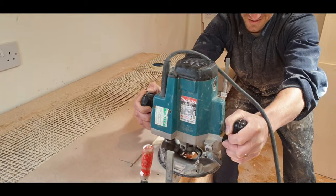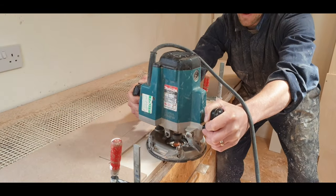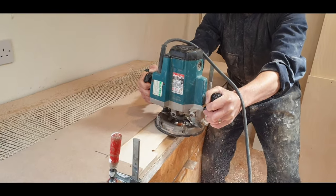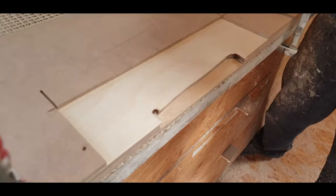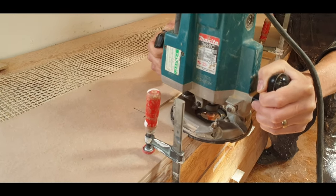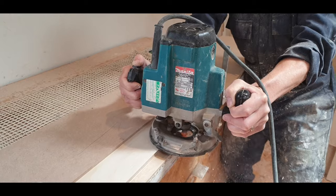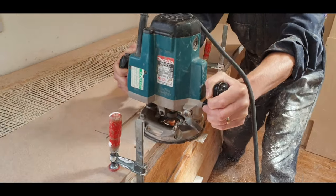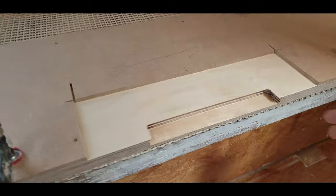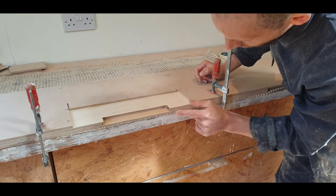It's driving so much better on the melamine. So that's the meat taken out — going for it now and going around the perimeter. One drawer fascia done. Let's take it off and show you what that looks like. You do get a slight bit of breakout but it's only on what we've taken out, not part of the drawer face — so that's quite nice.